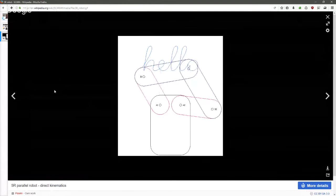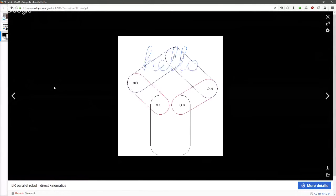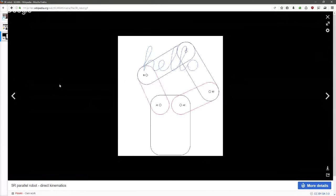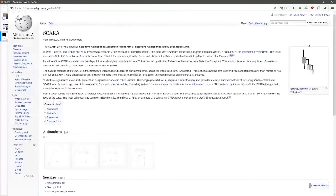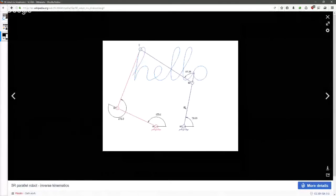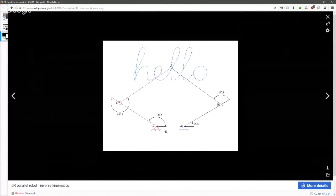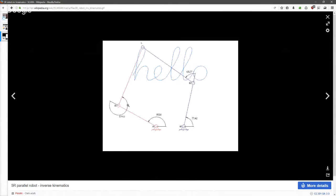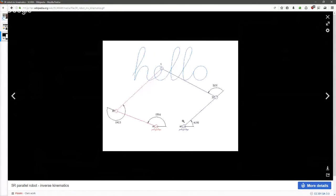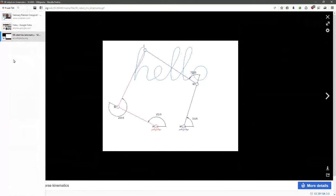And the big problem I've got with those is the same issue that polar robots have, that have just the one rotating table and then a second axis with that. They are really specialized. They have a bunch of downsides, like those extreme positions that Delta printers even suffer from, where you need an insane speed at your motor, or you just can't go there without literally over-cranking some of the joints. And it doesn't offer any advantages over just a regular Cartesian design.